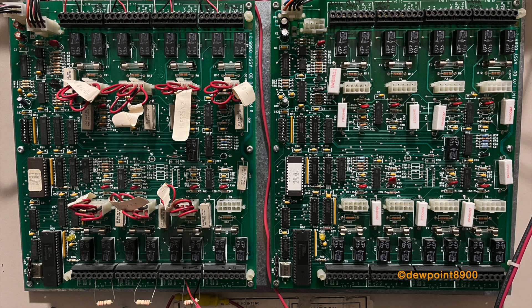The second and third bays hold various optional components. In this 4020, there are two 8-point I/O boards. Each board receives power and communication through harnesses leading back to the power supply. Other components can be mounted beneath these modules, such as a DACT, RS-232 interface, expansion MapNet transceiver, 4120 network interface, 2120 interface, and others.